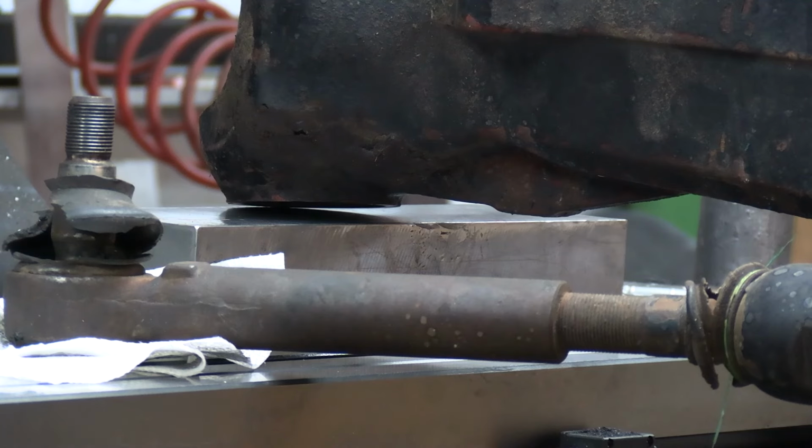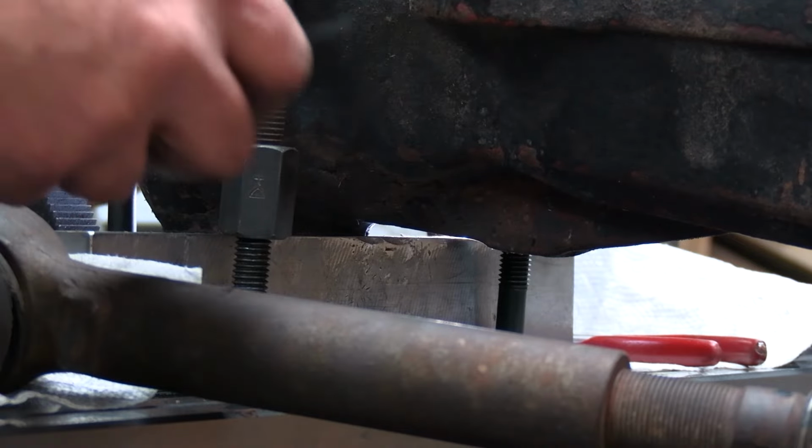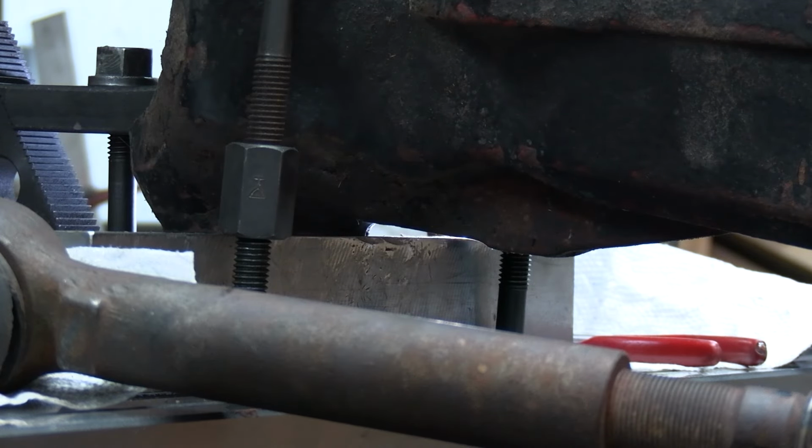But you can see there that my angle, that face is quite a bit off, so I've got to lower this end. So I'm going to pull the welding table out and get this lowered down just a little bit, and we'll bring you back when we get closer. So, got to play safe. Okay, I'm going to start with a close-up shot. And this is the 1 thou shimstock feeler gauge I picked up the other week, and it does not go in there.